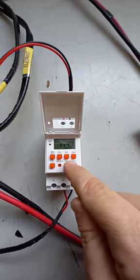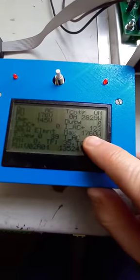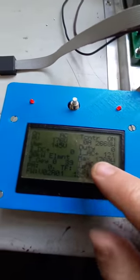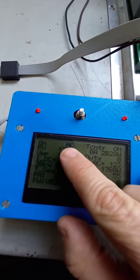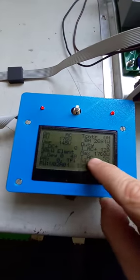I'm now going to manually switch over. We can hear it click over and now I can look at my units here and I can see this two-kilowatt element is now getting 1760 watts and I'm running on AC power. That's going to do that until I reach the max temperature that I've selected here.